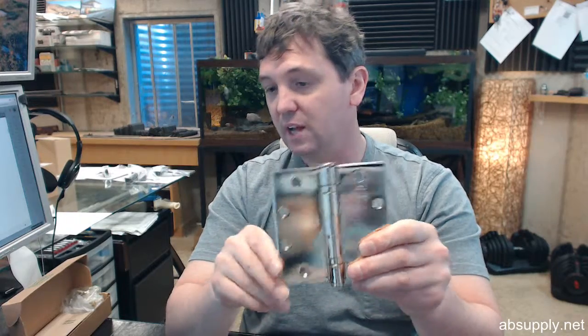If you change the 5 in the beginning of the part number to an 8, now you're dealing with a 3-knuckle hinge rather than a 5-knuckle hinge. A lot of people like 3-knuckle hinges. And if that 3-knuckle hinge becomes ball bearing, it's not BB, it's LB, because 3-knuckle hinges from Bommer are concealed. They're called lube bearing, is what that stands for. Then all the other things that we've discussed apply.